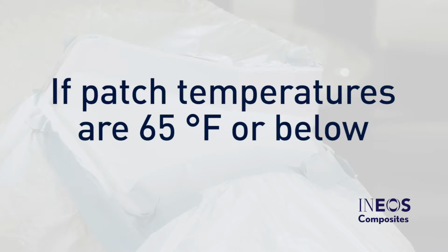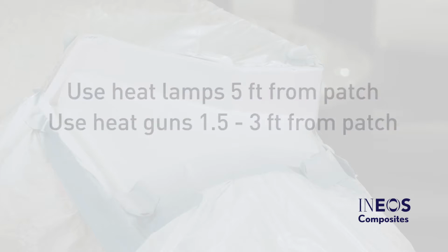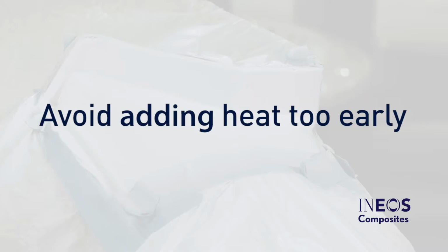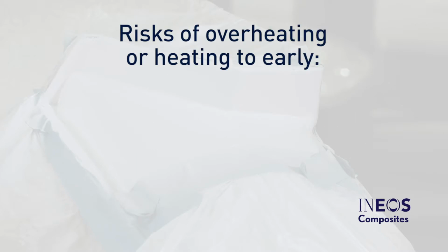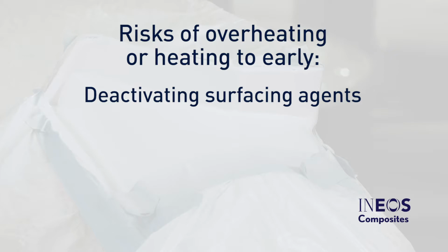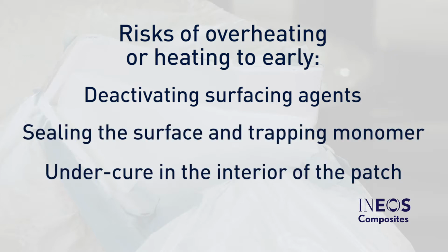If patch temperatures are 65 degrees Fahrenheit or below, heat lamps at 5 feet away or heat guns at 1.5 to 3 feet away can be helpful. Avoid heating the patch too early. Heating too early can actually extend the film cure of the patch rather than speeding it up. Risks of heating too much or too fast include deactivating surface agents, sealing the surface and trapping monomer, and undercure in the interior of the patch resulting in discoloration.